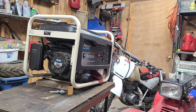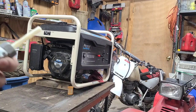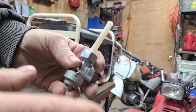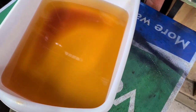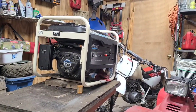We're back on the generator — it's actually a couple days later. We had a problem with the petcock: the handle is broken, there was no inlet for the fuel line. The fuel we drained out is no good either. You can see right there in the middle a big round circle — that's water — and look how dark it is. That fuel is no good; it's either been sitting and drinking up water or it's just degraded.